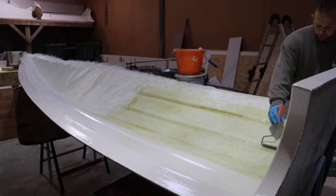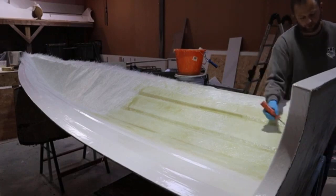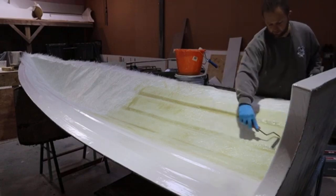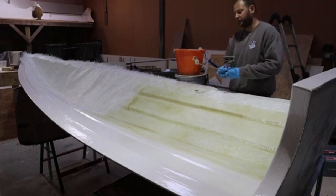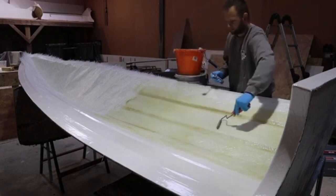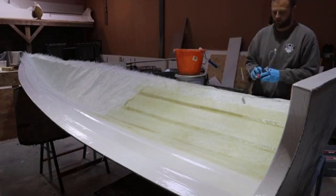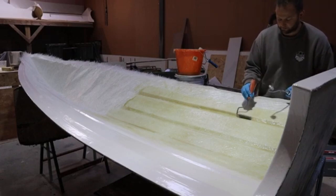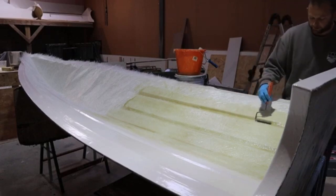So with this, try and just be methodical the way you're going about things. You know, break it down, look at the shapes, look at the lines, okay? So what we can do is work this single flat face. Once I've done this flat face, I'm not overwhelming myself by trying to take on too much. I'm not missing any spots because I know where I've gone with it, okay? So that's that one. And then you can move up and you can start working the chine, up and down and up and down. Work the chine. Start working the air out of there, stretching it in.